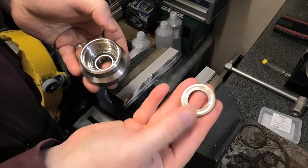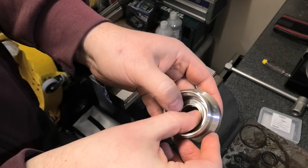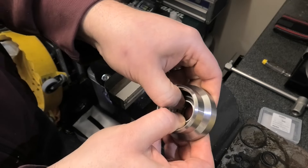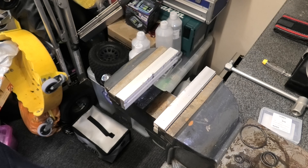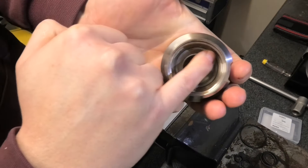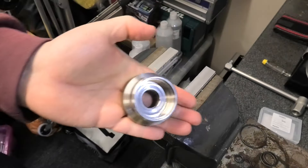Then lastly you've got the other part of the thrust axial bearing — that should also push straight in. There might be a slight interference fit, so they should be nice and flush all the way around the outside. If there are any issues just give it a little tap — nothing too hard, just a soft-face mallet on the inside — just tap it in so it sits nice and flush. If it has a slight kink to it you'll find the bearings will be a bit crunchy, so make sure it is flat and flush all around the outside.